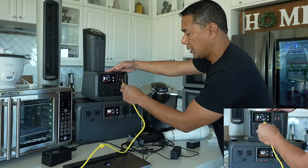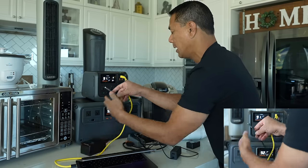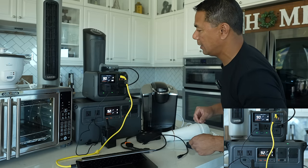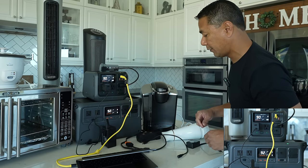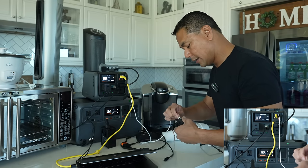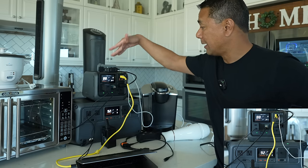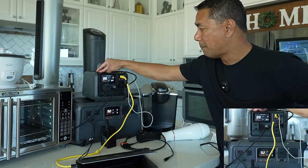I'm going to use the smaller one for now. I'll plug in my USB-C to a laptop, and I have a little V-mount battery — that brings us up to 80 watts. Plugging in the Air 3 battery bumps us up to about 135 watts or so. Let's also charge up the Osmo Action 4 — we're at 89%. So if we have all of this gear plugged in at a consistent rate of about 240 watts, we should be good to go for about an hour and a half.